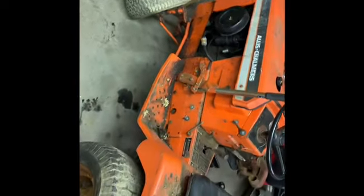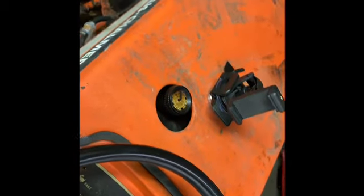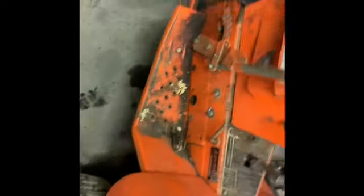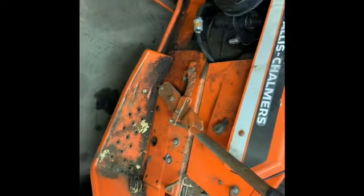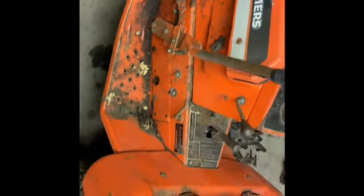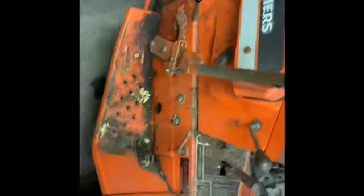Well, I put the plow back on this tractor and I ordered that. I did get this thing to turn over with the key again. Had to bypass, I think, safety switch to the PTO, I believe. Which I did once on the top side up here under the instrument panel there behind the battery and stuff. But I guess I had to bypass both ends or something.